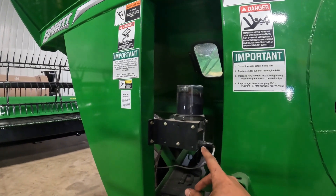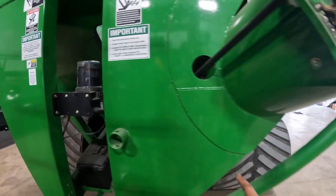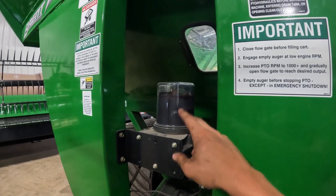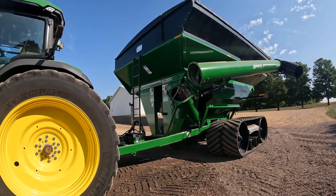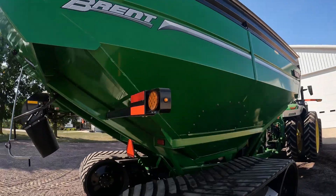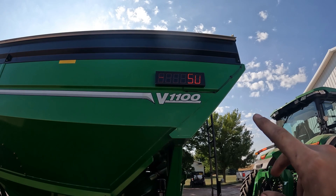This one does have an automatic greaser option. If I fill this with grease, it'll send the grease down to the bogey wheels in the tracks throughout the day, so I'm going to fill it up — it's only half full now. Now that all the hydraulics and electrical parts are hooked up, we're going to back it out and double check that the auger, the gate, and all the other hydraulics are working. I also want to double check that my scale readout on the side of the grain cart is working — and it looks like it is, I just got to zero it.